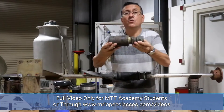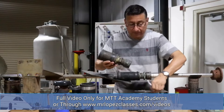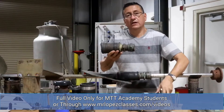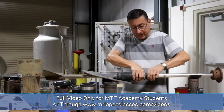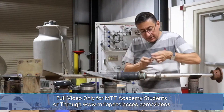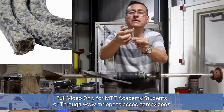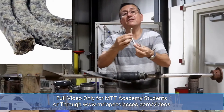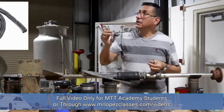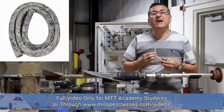If you disassemble, this is the typical mechanical stuffing box with seal packets. When you open this element, you find the seal. The seal is square. It's normally a special fiber impregnated with graphite, like this, or impregnated with an animal grease, with fat.